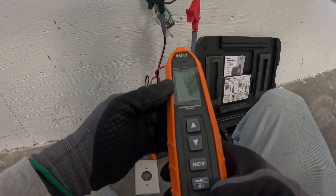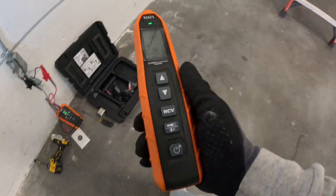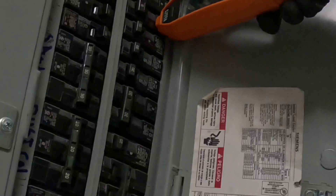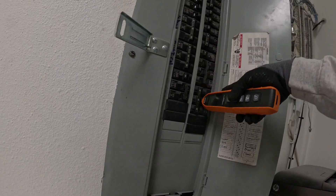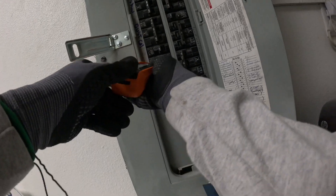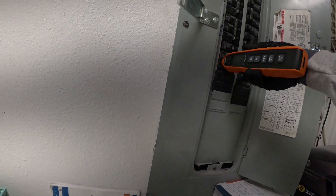If you do not feel comfortable dealing with any wires, make sure you contact an electrician. Now let's go to the other end and receive the signal that the transmitter is sending. In my hand I have the toner. This toner receives the signal — it pretty much listens to the signal inside of the wire. How I like to explain it is: if you had a man yell through a single wire like the Ricola man, this receiver listens on the other end.